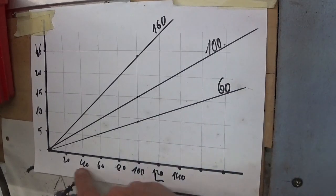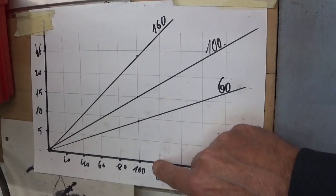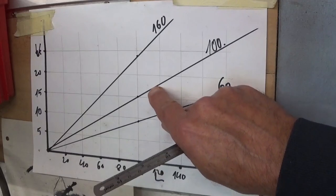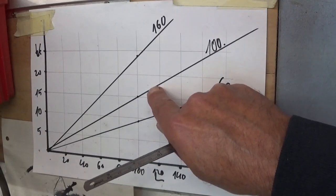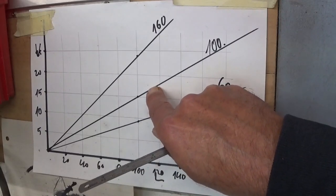The stroke length is marked here — it's 115mm — so we go to about this line. So I'm working on a cutting speed of about 18 meters a minute.